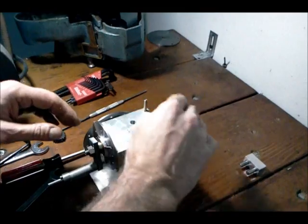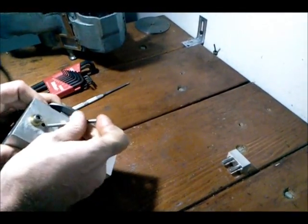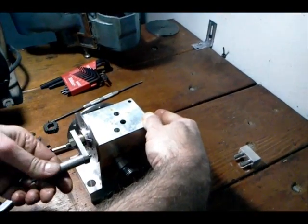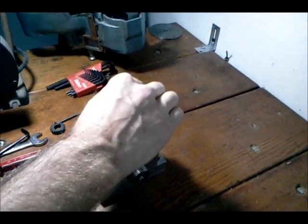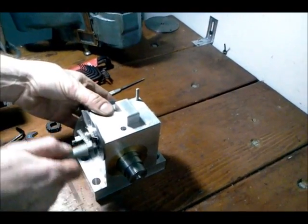The pin is held in place by a magnet so it won't fall out. I put it in the hole in the back, push it into the worm, roll it in place, engage it with the crank pin, and then put the block in. And I can do plain indexing from here.